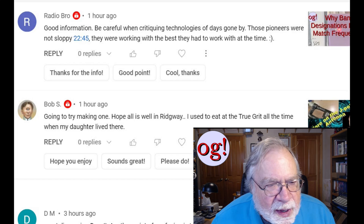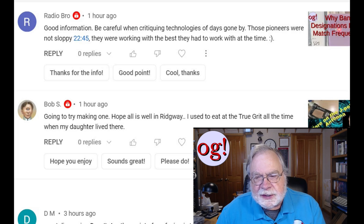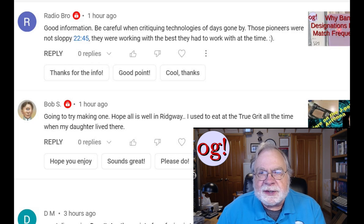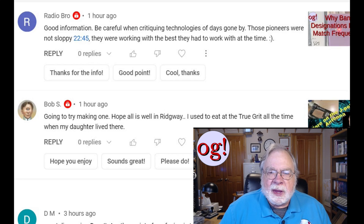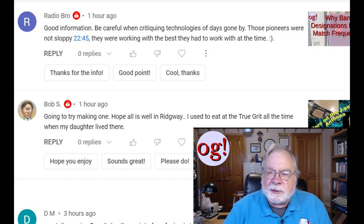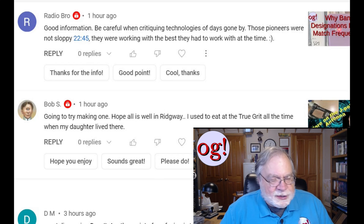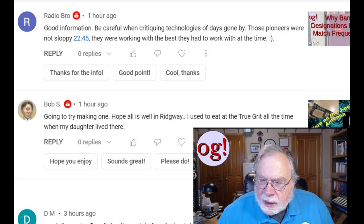Radio Bro, I agree with you completely — they were very sharp people. Radio in the 1920s gave way to the 1930s with CW, and there was an almost overnight two-year transition from Spark to CW. With spark, you'd talk about your kilowatt station, but only about 20 watts was actually going out on the air. A little 20-watt CW oscillator with a master oscillator and power amplifier was the way to go. It was also in that era that crystal oscillators proved so steady you could tell the difference in the length of a day from one day to the next — and that's why they went to a better definition of the second.